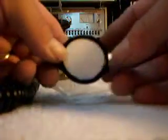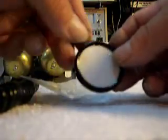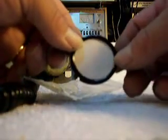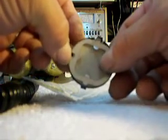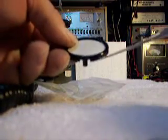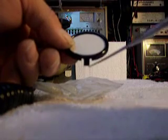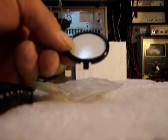This dial center ring has a metal ring and then some brackets right here to hold it in. There's a piece of plastic in there, and then your dial card. The customer does not want a phone number on this dial card, so we're not going to put one. It also consists of a little metal keeper on the back. If you look at this, one of these little brackets is smaller than the other one. We want to put it this way because the big end of the bracket is on the bottom of the finger wheel.